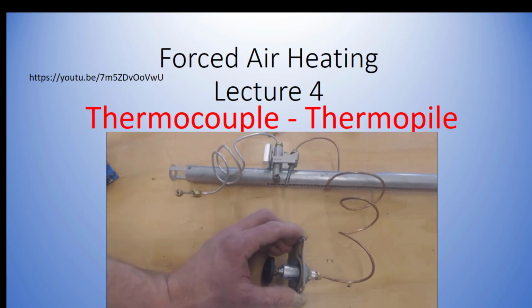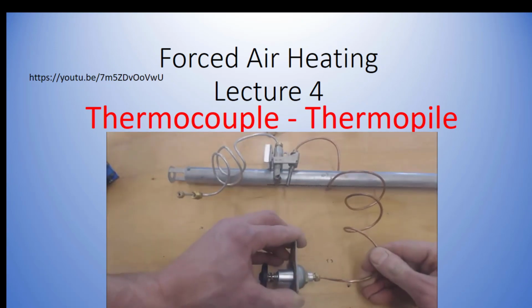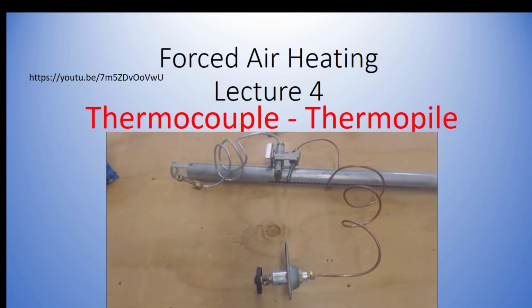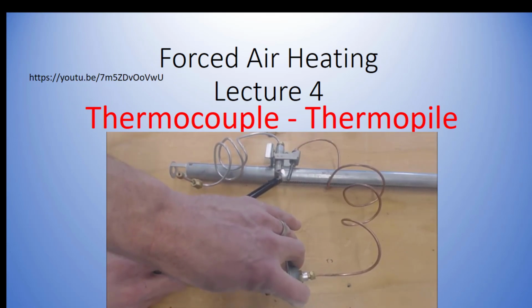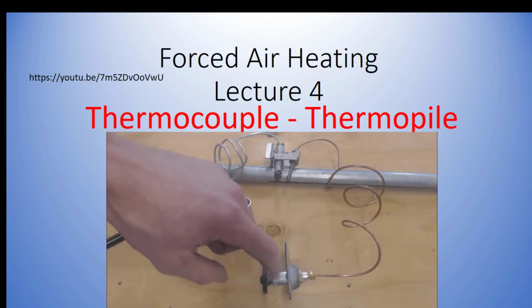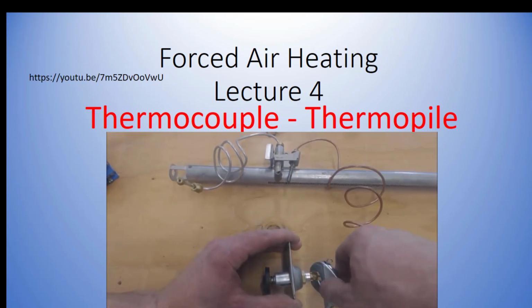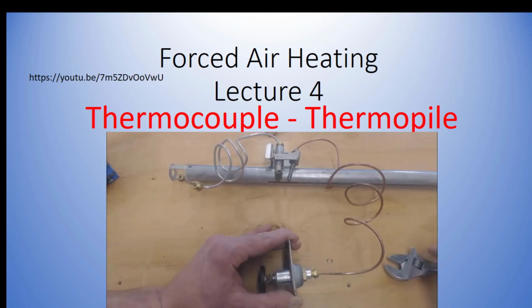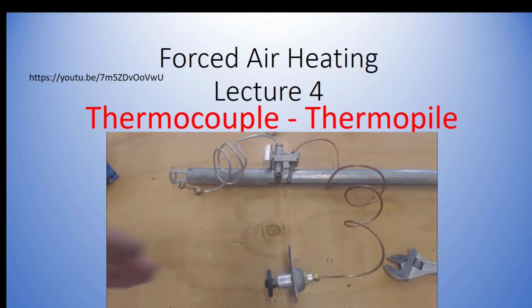All right, we're going to do the same thing again, but this time I'm going to disconnect it here. All right, so now it's holding it again, and we're going to go ahead and disconnect it. You see that? So we just loosened it. Let's tighten it again. Hold it in and see how it holds it. Okay, so that's the function of this solenoid along with the thermocouple.